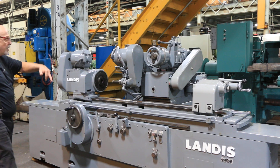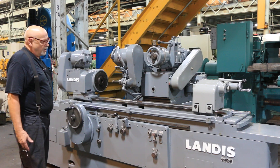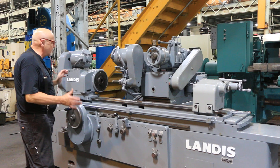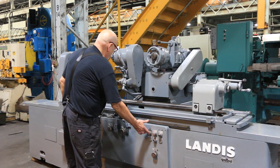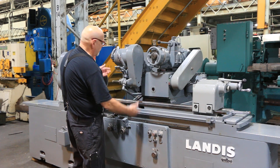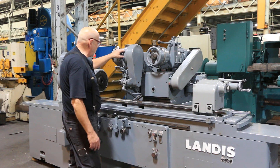Since I have the ID head down at the moment, I'll show you how that goes. Normally, guys would do the grinding by hand rather than using the automatic in-feed, because you really have to be careful when starting up the hydraulic pump. As long as one of these ID or external wheels is selected, the pump is going to come on.